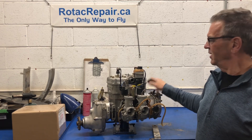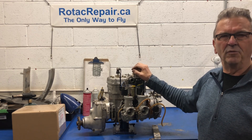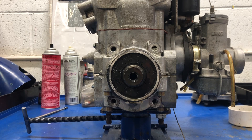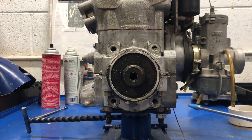The wisest thing to do is what we're going to do — completely dismantle it, check everything, make sure it's right, and then put it back into service. If you were ever curious as to what a 'provision four' engine is, this is it. On the PTO end it has four mounting holes instead of the usual eight that go all the way around on the modern engine.